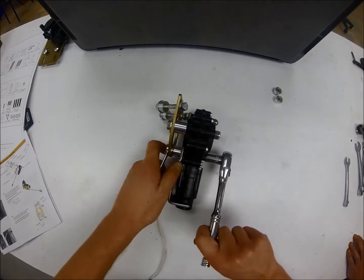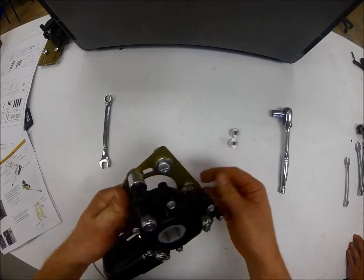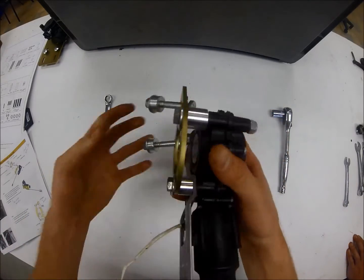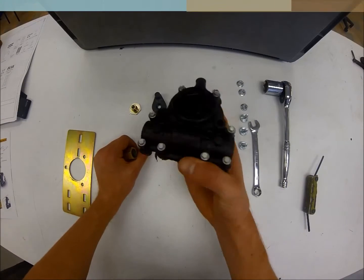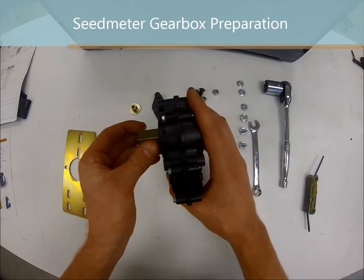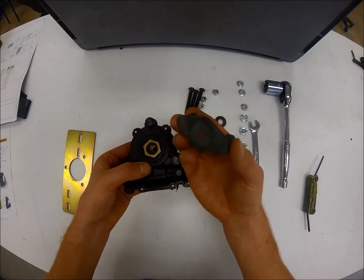The clutch is a wrap spring style clutch that is non-indexed with a 30 millisecond reaction time, allowing for consistent and immediate control of your planter. The clutch comes fitted with a standard 2-pin weather pack connector for compatibility with the majority of GPS monitors and controllers.